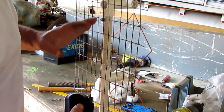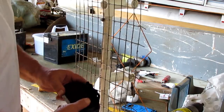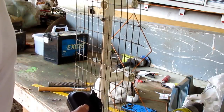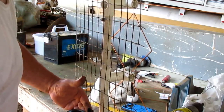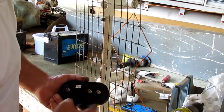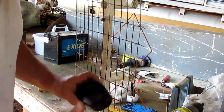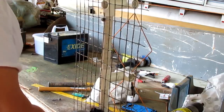If you live right in the city, you may not need this. Now, this is a RCA booster, and I use this one right here a lot. But they make some, I don't even know what you call it, you have to check on it, that'll connect the VHF with the UHF down here and convert into one wire. If you need a booster, one of these is UHF, one of them is VHF, and you connect your wires like that. I got a video on this on this channel. And I'm going to put my booster right here.